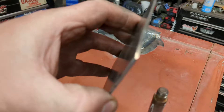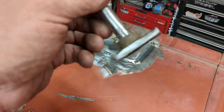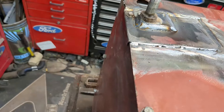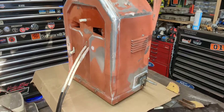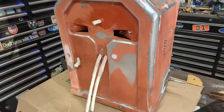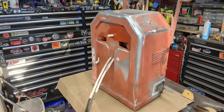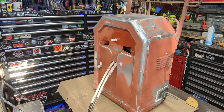That area was such Swiss cheese - I made a 14-gauge plate, which is about a sixteenth of an inch thick, trimmed it up, and welded it down over the damaged area. Ground the welds down a little bit. I bent over the backside of the little plate just a little bit so we can still get the back off, but it adds more rigidity right there. Time for some paint - threw a little bit of Bondo on some of the bigger dings. It was never perfect from the factory anyway. We got both wheels mounted on, and it deserves a lick of paint to make it look as good as it works. Let's throw down some red oxide primer from a rattle can over the bare spots, then Rust-Oleum red over the top.